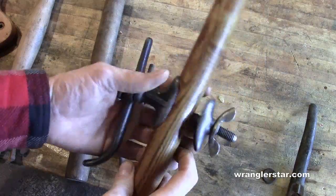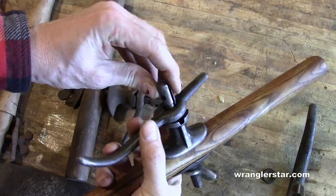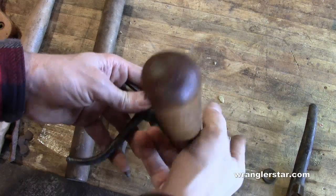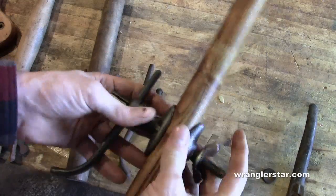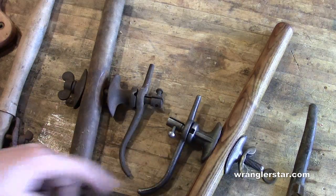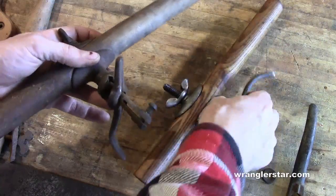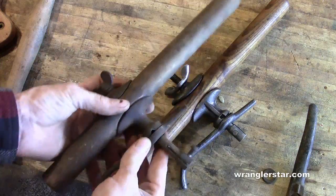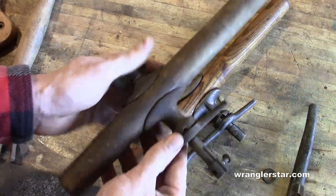And finally, the Pacific Coast type of handles — I had already decided on this before I started, but I wanted to show why and compare the different handles. This has a machined pin and a built-in hand guard. Not only is it reversible, but it's reversible in four positions, so you can change the handle and orient the saw horizontally — it just gives you all types of options and it's going to be perfect. I have actually been using this handle from Wanda, my six-and-a-half-foot crosscut saw, but it was definitely on loan and Henrietta cannot keep it — she needs her own handle. So I have one right here that I put together with a similar design. You can see the hand guard; I've got quite a few of them and they're pretty much universal. We'll restore this and fit it up to make a proper handle for Henrietta.